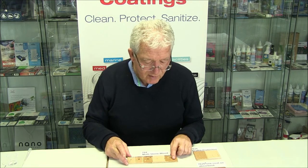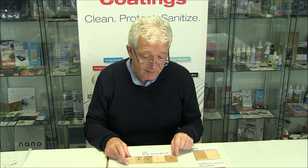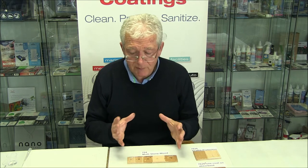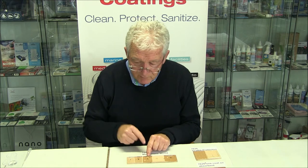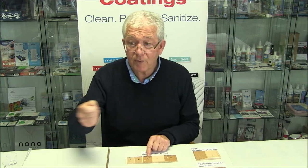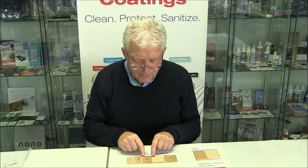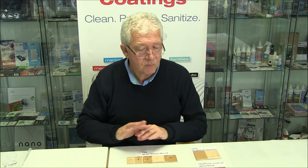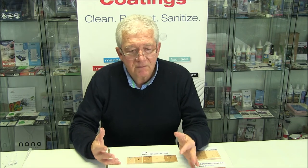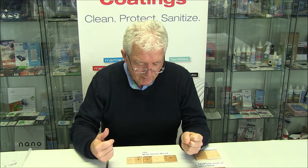The only consideration with this is slipperiness. When you get water on top of this, it's going to be quite slippery. So here is going to be less slippery. So in that particular problem scenario, I would be going 50% undercoat, and then you do the area, just spray it on, roller it on, however you like to do. It's very easy to use. And then I would put the top coat on, just walk away. It's walkable on after, it's best 24 hours, technically 12, but I prefer to leave it longer.